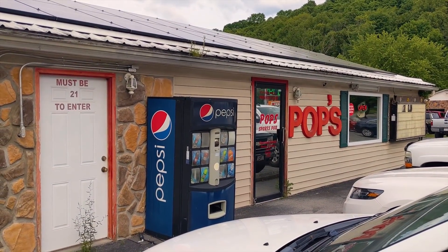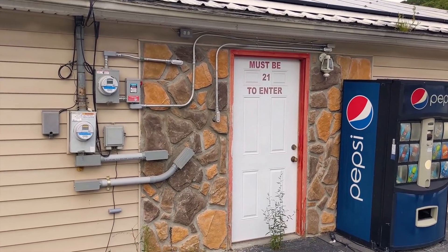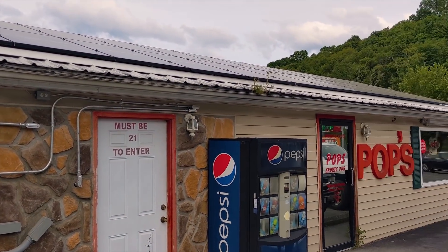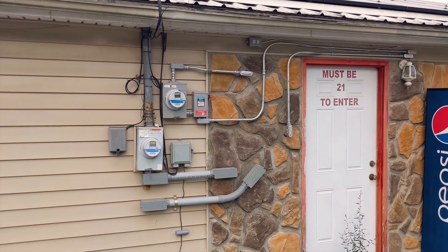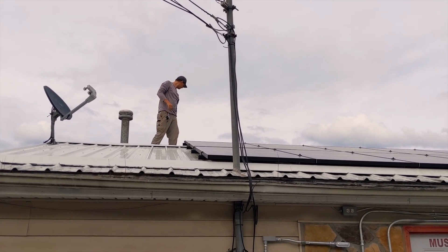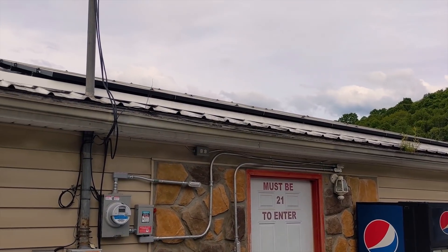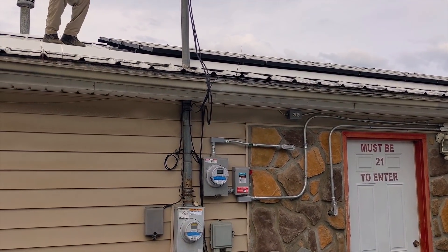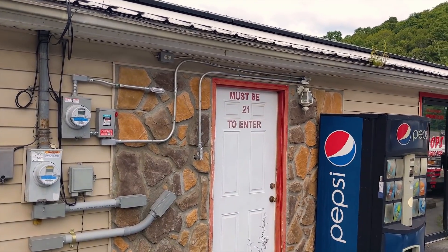Finding Solar Arcs in the most interesting places — we're in West Virginia and this system was not producing what the customer hoped. We went in and basically it hadn't been turned on, and the customer couldn't get a hold of the installer. We're just double-checking a few things. They've got 48 panels on this thing, so I'm worried about a VOC violation on the string. Johnny's checking what panels they are — trying to figure it out because you don't want strings of 12 on a 60-cell panel; you're going to be over. Looks like Everest panels, Everest rails. Anyway, we're doing a little investigation after work — not really trying to drum up more work, but it just sort of shows up.